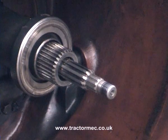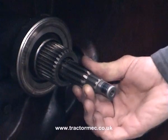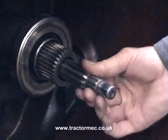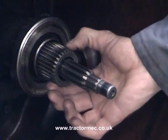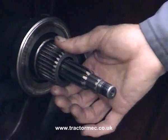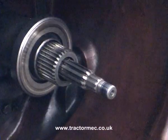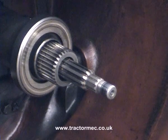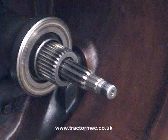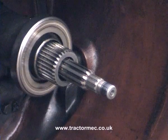Here on the 4000 we can see the two input shafts going into the gearbox. We have the main transmission shaft, the smaller shaft, and then that goes through a hollow PTO shaft carrying the PTO drive into and through the gearbox to the hydraulic clutch pack, behind which we have our release bearing. If we spin it you can just about perhaps hear the ticking sound,